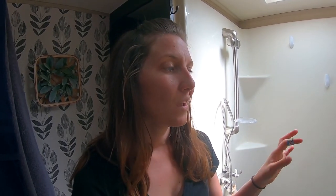There are a couple on the other side over here that I'm looking at where you can see a little bit of the gray, but my curtain's gonna hang on that side, so I don't really care. It is solid. It's just that you can see through the silicone because it's somewhat clear still, even in the color. So it might be that when this dries you won't see it at all, but because it's still wet, I can see some of it. But I'm really, really happy with it. I would give you the tip to make sure you fill it and use a razor blade to slide across it, smooth it out as much as possible, and then clean up those edges so that you don't have silicone globs on your shower.